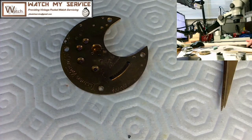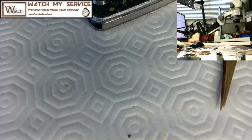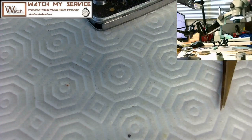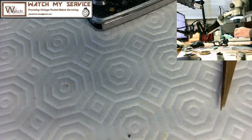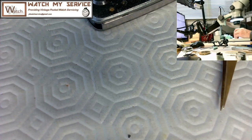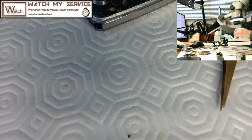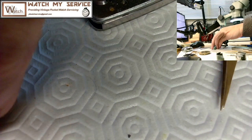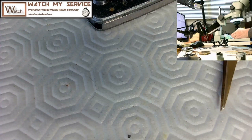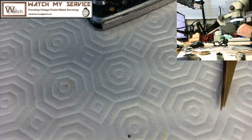I'm spinning it over and having a look in the microscope at this jewel setting, making sure I've got all the debris out. I'm just going to zoom in on this setting to make sure there aren't any residual issues. I think there's just a little bit of stuff in the bottom that I need to use my Rodico to get rid of. Let me just get in here with my Rodico — I think some of the stuff I'm seeing is wood from the pegwood.